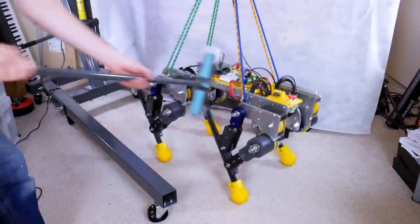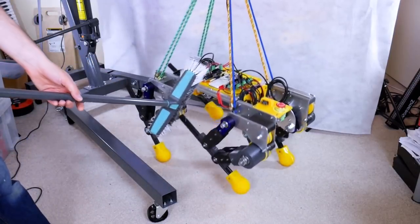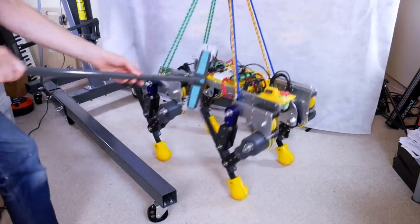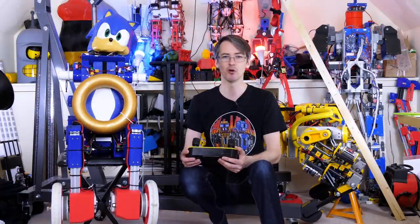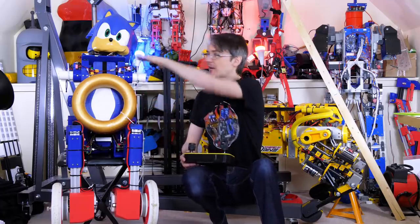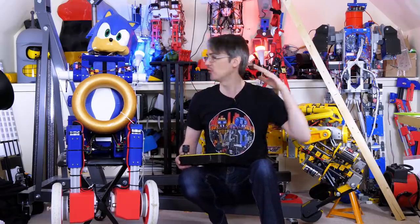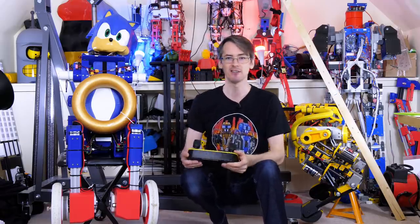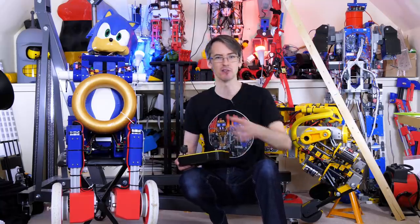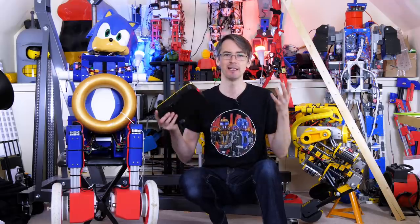I think that the dogs I did, which actually had backdriveable gearboxes, were probably more dynamic, so check those videos out. But that's something I have to think about in the openDog development, which is ongoing. So there were quite a few more crashes, which resulted in one of the legs breaking off in the end completely, the IMU getting skewed because the electronics were not at the correct angle, and therefore it ran off into the hedge at the end, and that completely broke the leg. So there are quite a lot more crashes I'm going to put in the outro to this video, which weren't in that edit. There are a couple, and that was mainly down to three things.